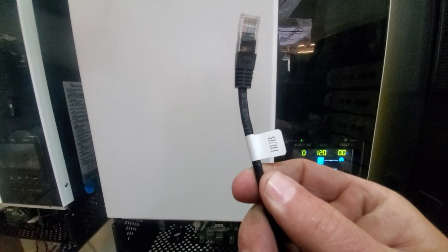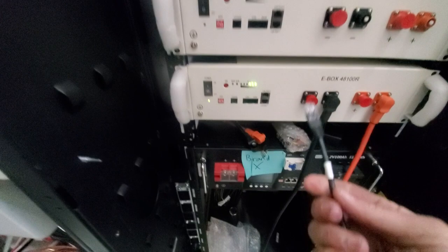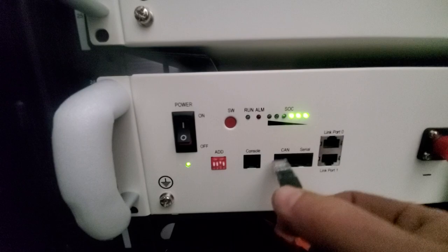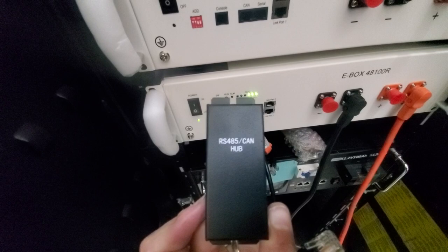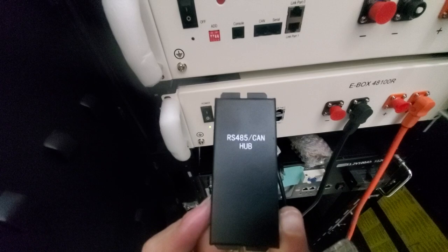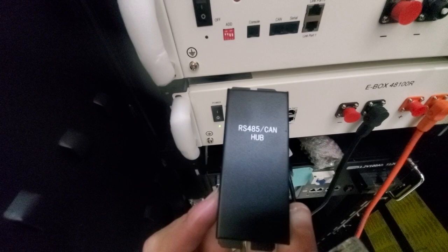It's working perfectly. Here's our cable — you'll notice the GrowWatt cable says 'hub' on one side. This is not a straight Ethernet cable; as shown in Appendix A, some pairs are swapped around. That end goes into the battery because GrowWatt uses CAN bus — we plug it into the CAN port. You can see the state of charge is three LEDs. The 'hub' side would normally go into a CAN hub if connecting more GrowWatt inverters, but in this case we don't need one. I'll show you how to go ahead and plug this straight into the GrowWatt CAN port underneath.